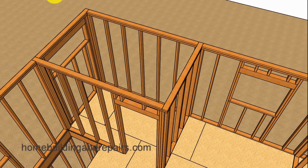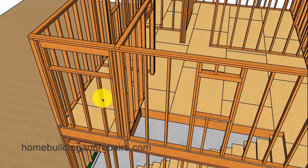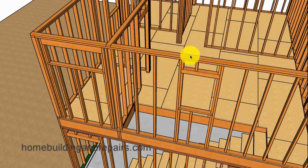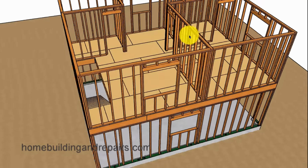And then our bathroom, and here we have a 4 foot wide by 18-inch tall window, and your window might need to be a little smaller depending on the bathtub or the bathtub surround you're going to use. And we are also going to have a window in here to provide us with a little more light for the stairway, and this window right here might need to be tempered glass. And now we will take a look at the outside here.